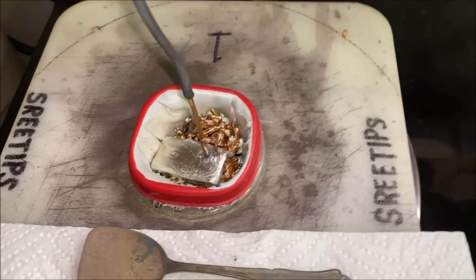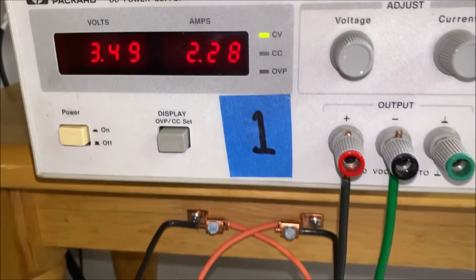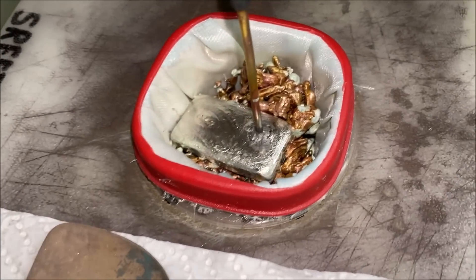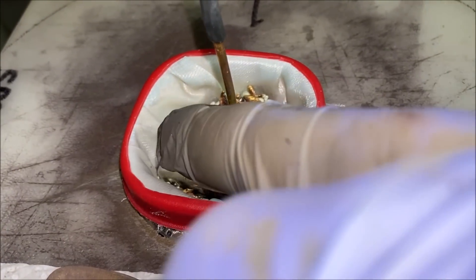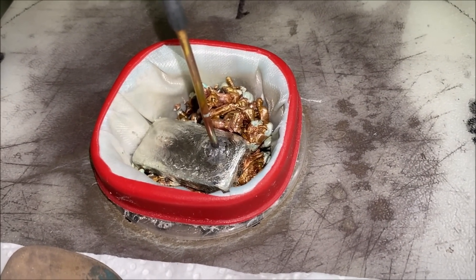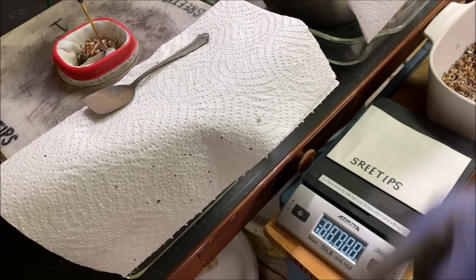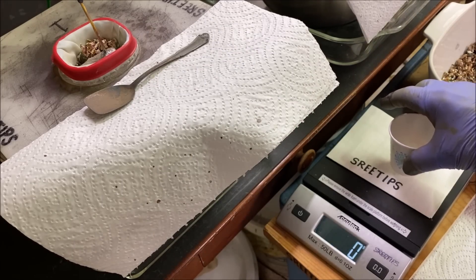It's only been a little less than 24 hours since I filled that anode basket up. The current flow is high — it's really going through the impure silver shot very quickly. If you notice, my electrode bar is down low in that filter and it's coming in contact with the edge of the electrolyte-soaked filter bag, which will cause that anode electrode bar to dissolve. We filled the anode basket on number one about noon yesterday and it's probably 9 a.m. right now.